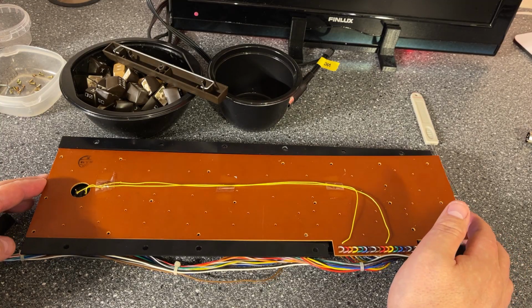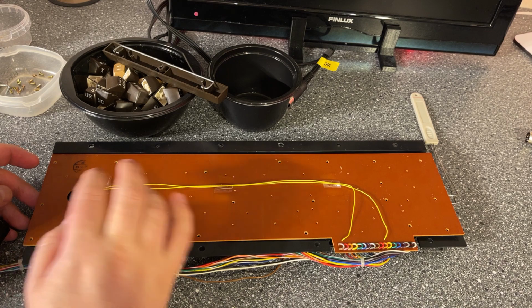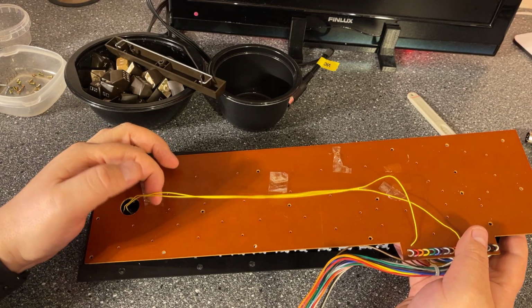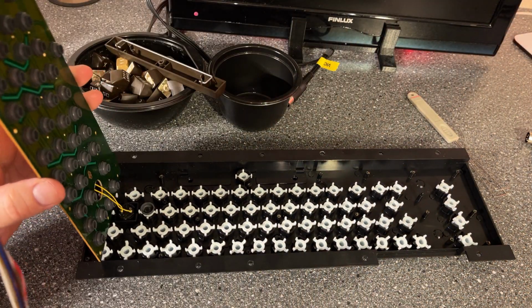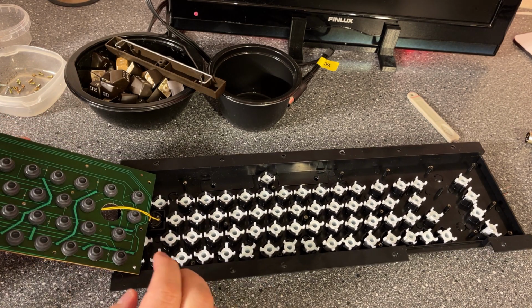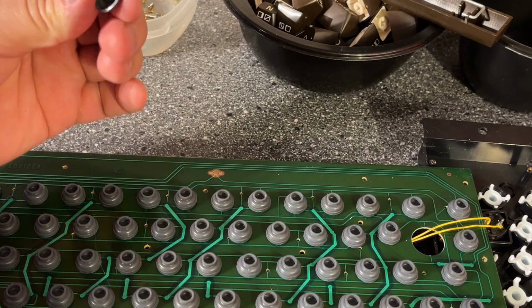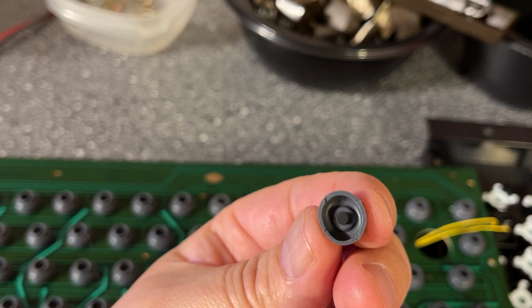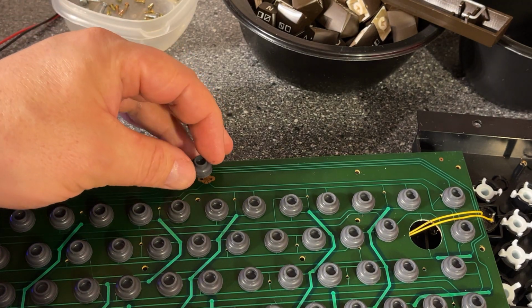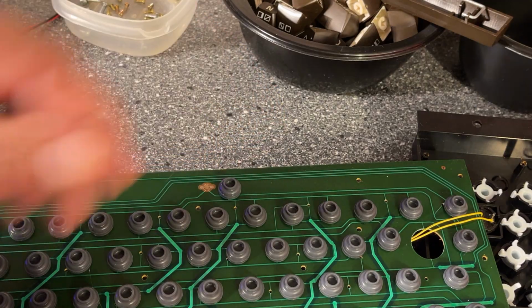Let's peek inside. And yeah, the caps lock key is holding this back. Now I just loosen the tape and then it can be flipped over without desoldering. Good. And here we see these rubbery things that are the spring for the keys. So this is a bit special keyboard, and all of this has these plungers in the middle that I guess it's carbon, and all this pressed down to its individual contact, and this is just a copper contact. So yeah, all this needs to be cleaned.